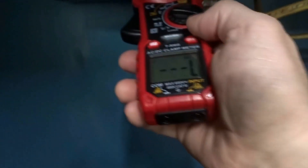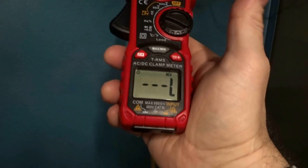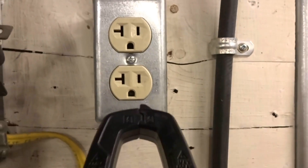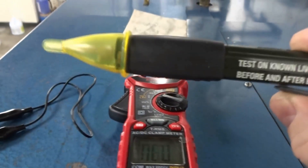With this tool, as long as you're in that range, you take the little part and touch it - you can see the screen turns red and it says it's hot, warning you. Same thing with that line - it's hot. Now this other line, it's saying low voltage, still telling you it has voltage in it, so it's hot but it's a low AC current where this one doesn't have any. If we come up here, touch the neutral it's showing low voltage, ground shows nothing. So if you get this meter, you don't need to get a separate NCV meter.